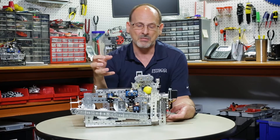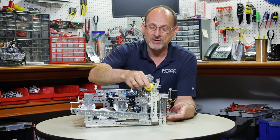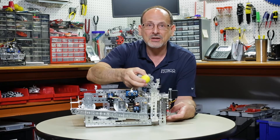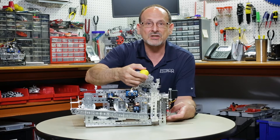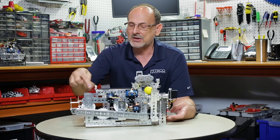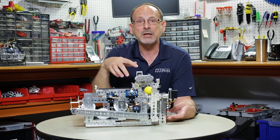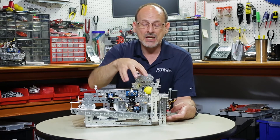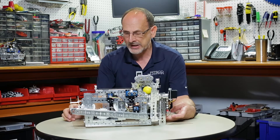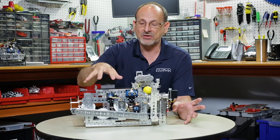This is one of those extra learning moments you get with a model like this — Newton's law: a body wants to stay at rest. When you start moving that belt, it could actually rotate the ball instead of moving it along the belt — the ball just spins. So I added the little rubber treads and had to tweak it in several places, including adding sensors so the Prism could understand where the part was in the process.